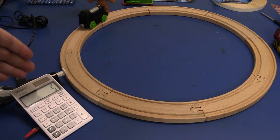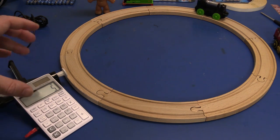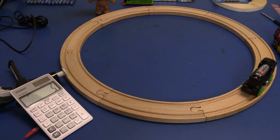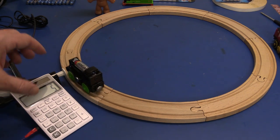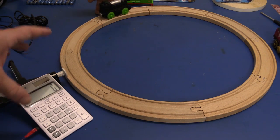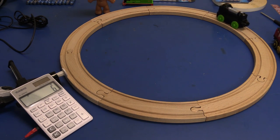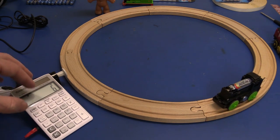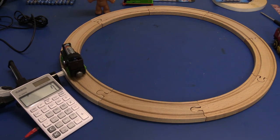And yes, it is just a switch input to this thing, so you can't use a digital input or anything like that. It has to be just an open contact switch. And if you had some other input that you wanted to drive, a noisy input you might want to clean up first, then you can do the output using a transistor or a relay or any other system that gives you more or less a contact type output, because remember, this is a matrix keypad. It's not just individual keys with pull-up resistors or anything like that. They're not digital inputs. So there you go.